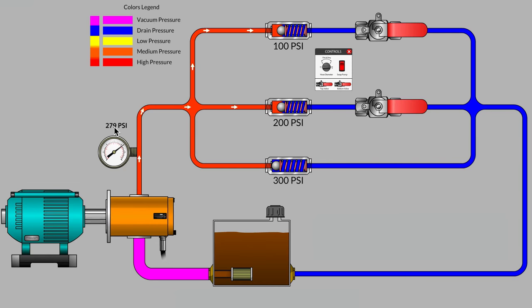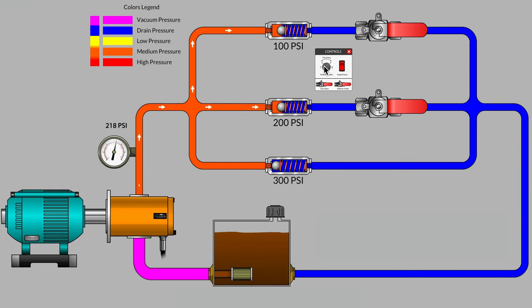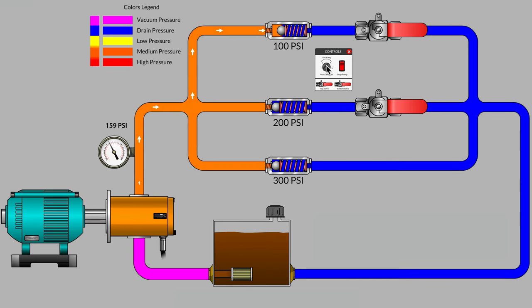So how do we get the extra pressure from the hydraulic hoses to disappear? Well, why don't we go ahead and just increase our hose diameter and let's see what happens. Let's magically increase to 1 larger size of hydraulic hoses and tubing, and we find out our system pressure drops. What do you think will happen with our 2 flow paths when we move to the next size of hydraulic hose? Let's upsize once more and see what happens.